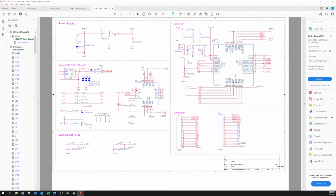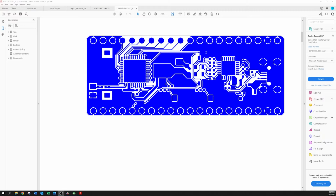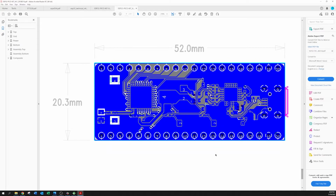But anyway, as you can tell, it's not connected, right? It's not connected on the old one either. They both have the resistors, but there's no pull-up, right? So then I say, okay, we might as well go all the way down the rabbit hole. Looking at this, there's no pull-up resistor. Something's got to be feeding power to it, right?